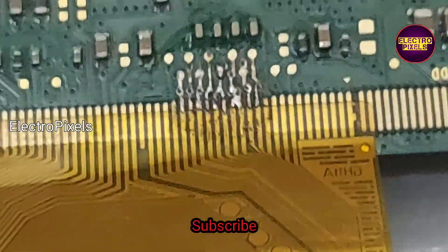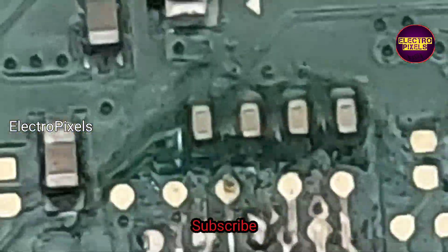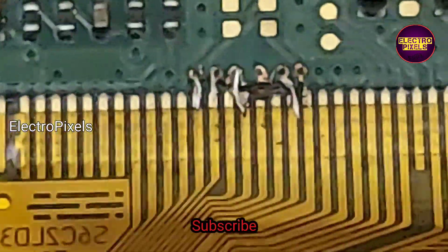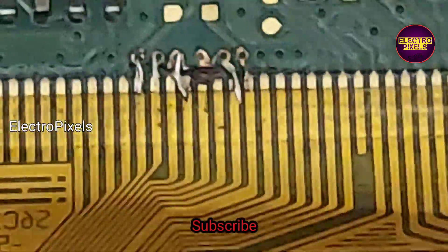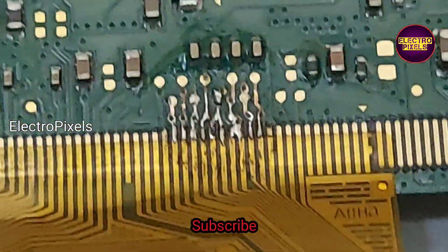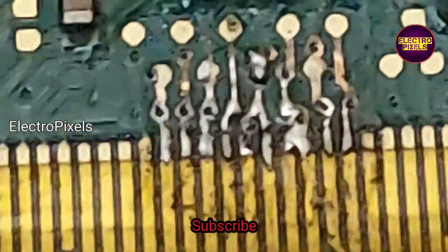So instead of the VOF track, all other tracks are joined. Moving to the left side gate signal track, the problem is with the CKVB1 track — the shorting is on CKVB1. If I join the CKVB1 track then the DC-to-DC IC goes to protection mode. So on the left side of the panel the shorting is with CKVB1.